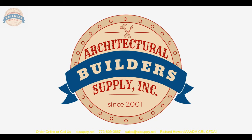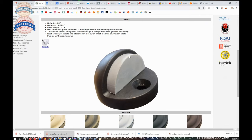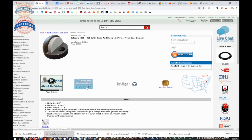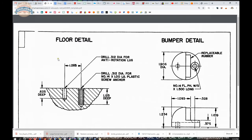Let's switch to the screen view where we can take a closer look at some supporting documentation. This is the item we're looking at with our description. We're not going to see floor stops in hospitals — as a general rule nothing pierces into floors when it can be avoided. A template link here gives us the dimensional properties. You do need to drill two holes: that post sticking off the end is needed to prevent the floor stop from rotating or spinning.